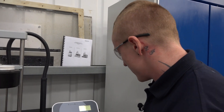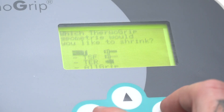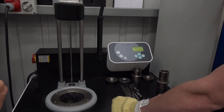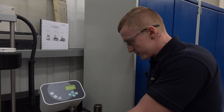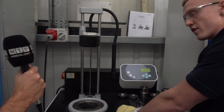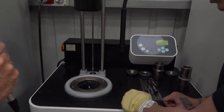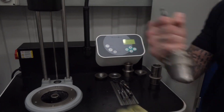I'll take these gloves off now. The cooling time is set — you can alter that, but it's a set time until it's cooled. You can alter all your parameters for how long it puts the heat in, how long it cools down, how long it dwells for. It does from 4mm up to 16mm, even bigger up to 20mm — but it's been ideal for us here. We use that in every job we do. And when you've got a lot of tool changes, you're forever setting up and breaking down, so it's really handy to have. All it's doing now is blowing air, cooling the product off. And now you can just grab it — it was really hot and now you can touch it and walk off and put it straight inside the machine.